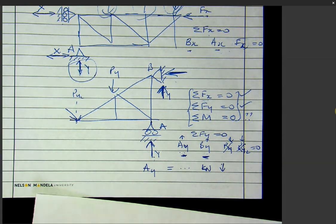Now there's a problem. Remember, the upcoming test. We said that the session is a question and answer session on trusses. Is that right? So for a truss, I can't give you a truss that has a uniformly distributed load. I can, but it's going to be a bit complicated for you. The forces that you're going to deal with in a truss are point loads. If you look at my tutorial question, I've given you only point loads, not uniformly distributed loads. So you won't have that.